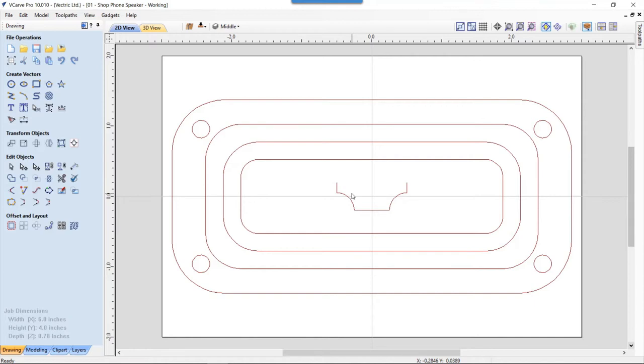A lot of these form tools, you could actually go on to the manufacturer's site and download a profile. But in this case, I actually had to draw it by hand, which was just very basic measurements off the side of the tool. This is a 1-inch round tool, and this was a 1/4-inch arc here. So from here to the outside edge is a 1/2 inch. So it was really quite easy to draw. And I used this so that I could just roll it over my image and make sure that everything was where it should be, having these offsets correct and knowing what I was going to do.